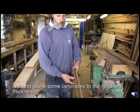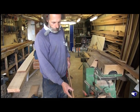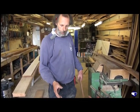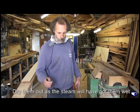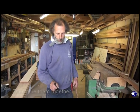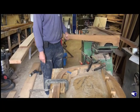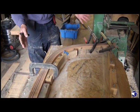Cut and plane some laminates — there are really two ways of bending them. One is to cut thicker laminates, steam them, clamp them around the jig, leave them for a few days to set in that shape, then take it all apart, dry them out because the steam has made them wet, let them dry and then glue them together. The method I prefer is to cut thinner laminates that will actually bend around without breaking and without any steam. These have been clamped around this jig for about a week without being glued, hopefully getting them used to being that shape.